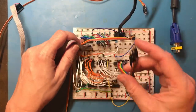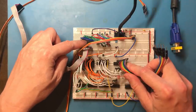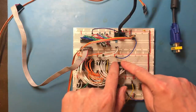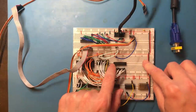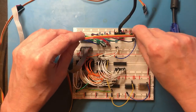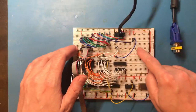We've modified the clock to take the derived clock from the CPU but we're not going to need that anymore. Let's go back to driving it from the crystal, using the divider to divide by 16. I'm going to disconnect this chip because it's going to be driven from somewhere other than an IO load operation. That's where the main bus needs to go, but we're not connecting that right now. We'll pull that line high so this isn't outputting to anything.